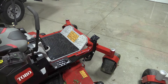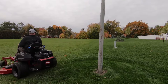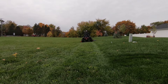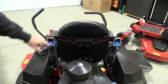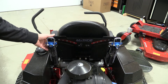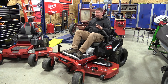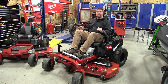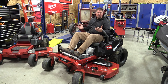Our Titan has the MyRide system on it, and this MyRide system is available on both the Titan and the TimeCutter. They are positioned slightly differently on each model, but they do the exact same thing and are both adjustable for firmness — I have mine set all the way to four. Basically you have a coilover shock with about three inches of suspension. This system completely allows the operator to ride independent of the frame and the tires, so the frame, deck, and tires are all consistently running over the ground giving you a completely level cut — whereas front-tire suspension would allow the deck to move up and down and give you a more wavy cut.